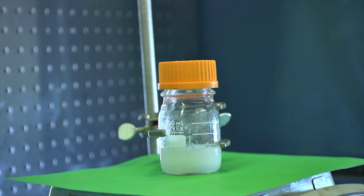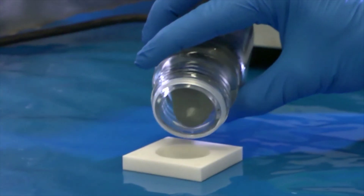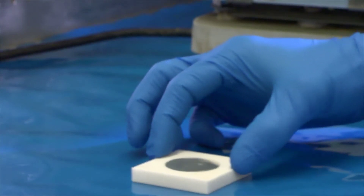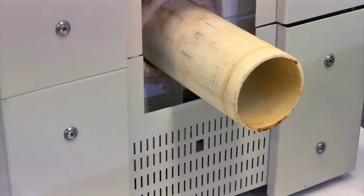Our process is simple, scalable, and manufacturable. We start with a mixture of oil and water and emulsifiers, not unlike the ingredients in salad dressing. We add in zinc powder and let it stir until we get a uniform emulsion of zinc that can be poured into a mold and dried overnight. A benefit of this approach is that the size and shape of the mold will ultimately define the size and shape of the zinc sponge electrode that results, allowing us to produce cells for size and shape-dependent applications.